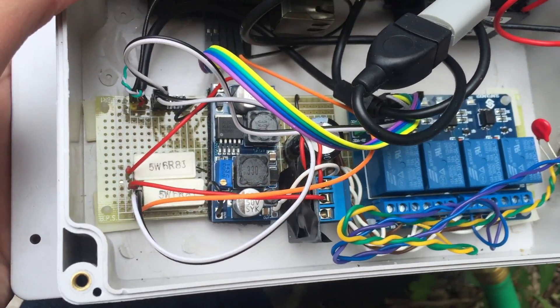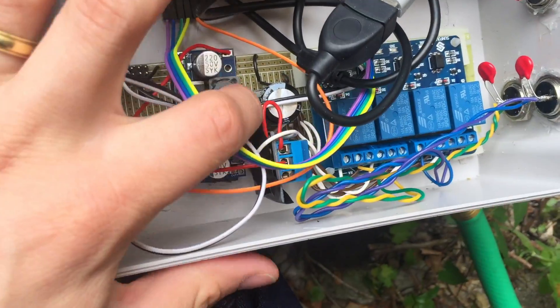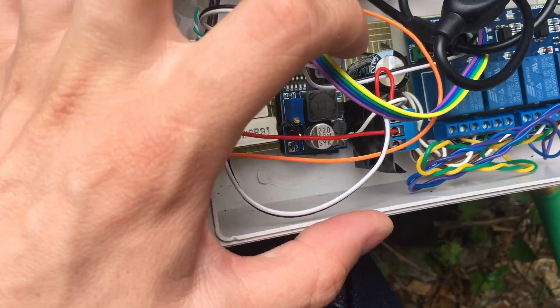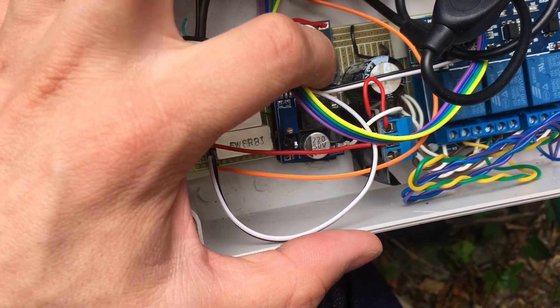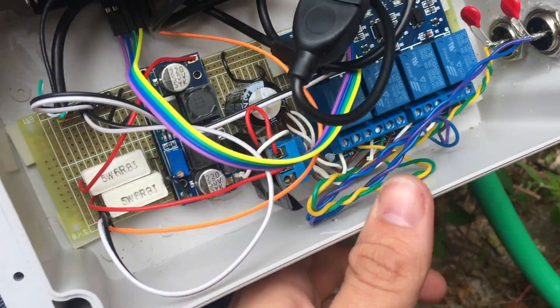That's the hardware side — not too bad, but it took longer than that. There's also this capacitor which basically acts as a bucket: the 24 volt charge gets dropped in here, the supply turns off, and then the bucket gets dumped to the solenoid, so it doesn't have to run all the time and draw too much current.